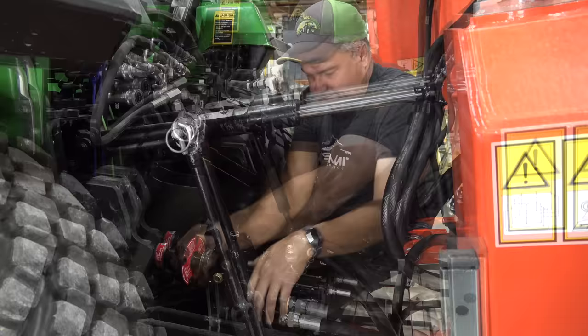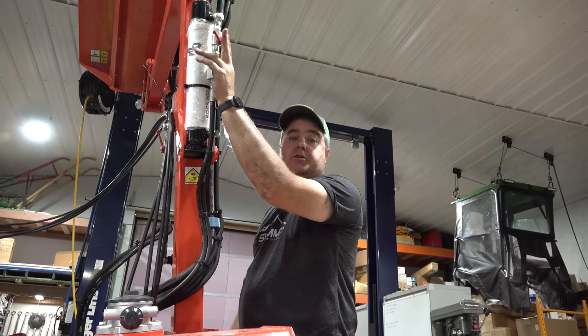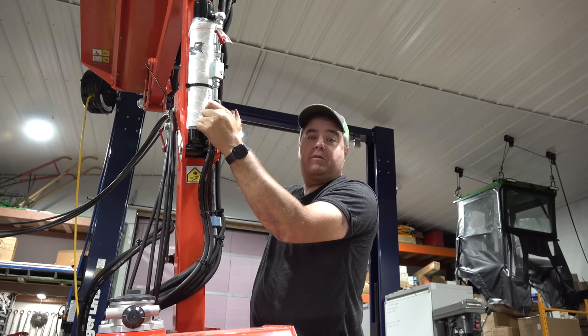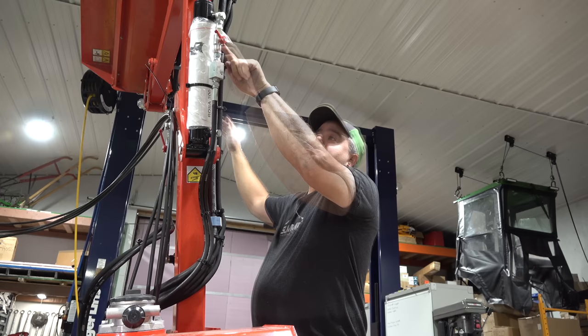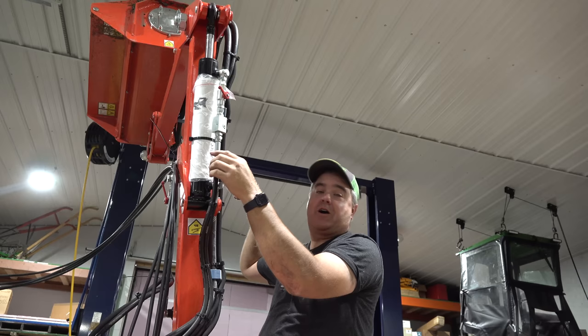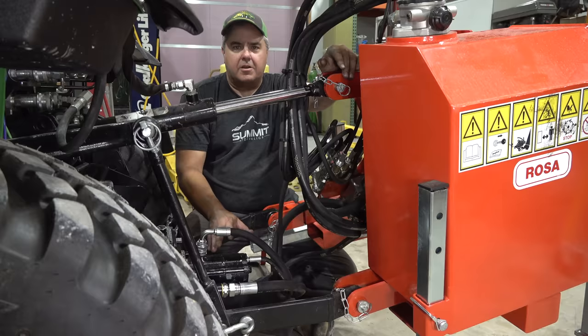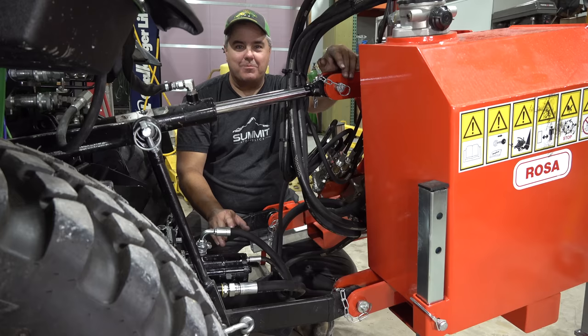We still have this little sideways rotation that we have to do — I have to pick it up and take all the weight off to try to rotate. This time I'm going to tighten it up tight. Here's a perfect use for the safety lock. I do have the mower held up, so if it fell on me it wouldn't be pleasant. By engaging the safety lock, the only vulnerable parts are from here to here — the cylinder would have to somehow fail. No hydraulic hose is going to burst and cause this to drop. It's a nice safety feature.